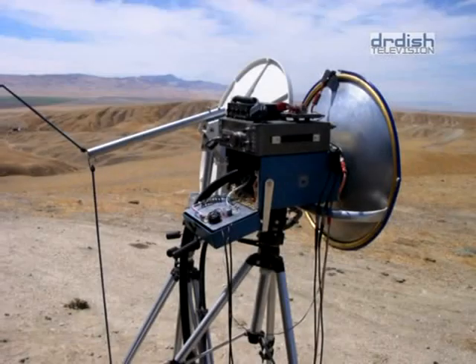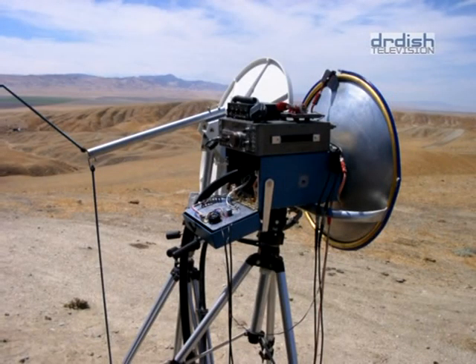Have a look at a short video. Radio amateurs use the 10 GHz band for ATV, which stands for amateur television. Of course, you can get the right LNBs for that particular frequency from your local amateur TV specialist, but they are quite expensive, and whoever calls himself a true ham radio amateur will try and modify an existing LNB by himself.